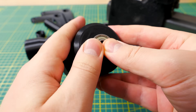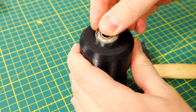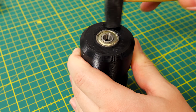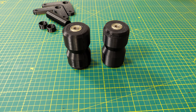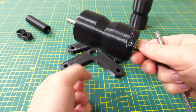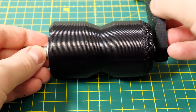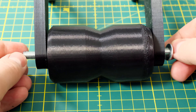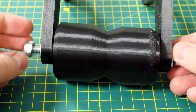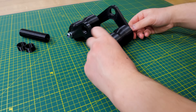Back to the assembly. I'm going to start by installing bearings into the roller wheels. The best way to do this is using a vise and press fitting those in place, but a hammer is also an option. When this is done it's finally time to put everything together. First push an 8mm threaded rod through the roller wheels, then a washer for both sides, the 3D printed sides, one washer, and a lock nut. Tighten this up but not too hard, otherwise the rollers won't spin freely. I repeated the same process for the other one and it's working exactly as I expected.